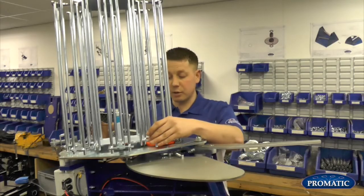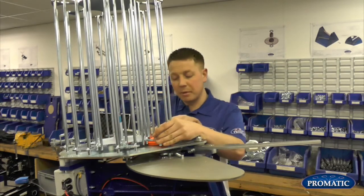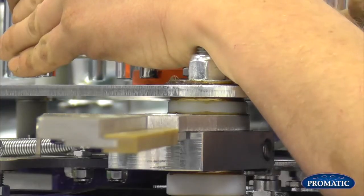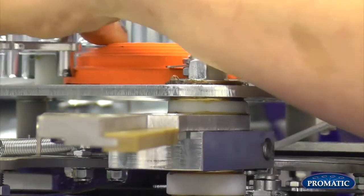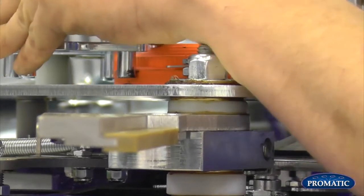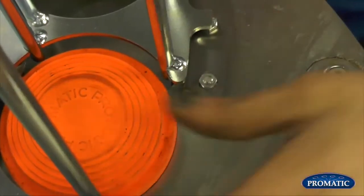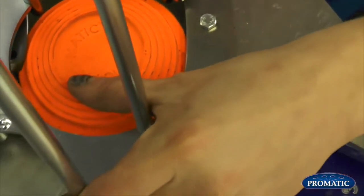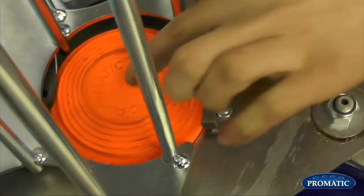As we bring it to there now, we're looking for a couple of millimetres from the drive band of clay front and back. If we can achieve that and get the clay passing through the knife edges without it coming into contact, we know we've set our knife edges correctly. When we come to set the knife edge, and as we bring the clay in there now, what we're looking for is an equal gap front and back.